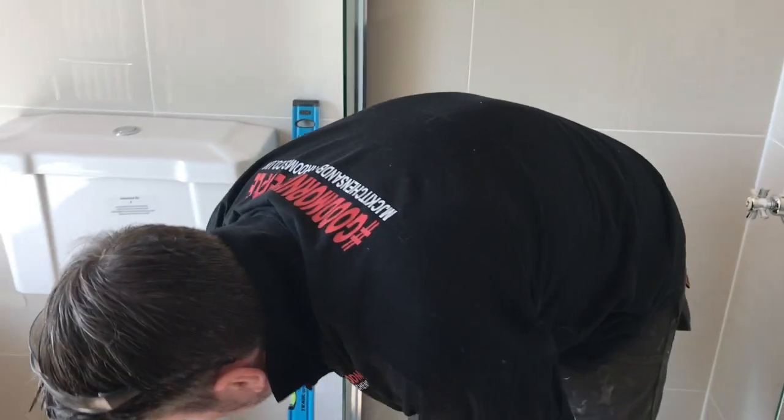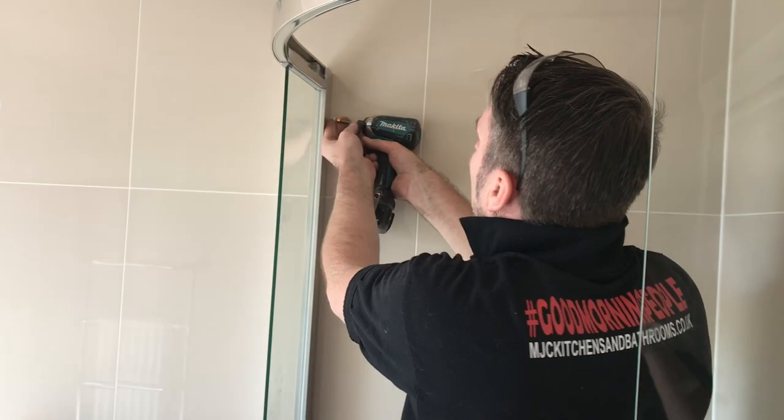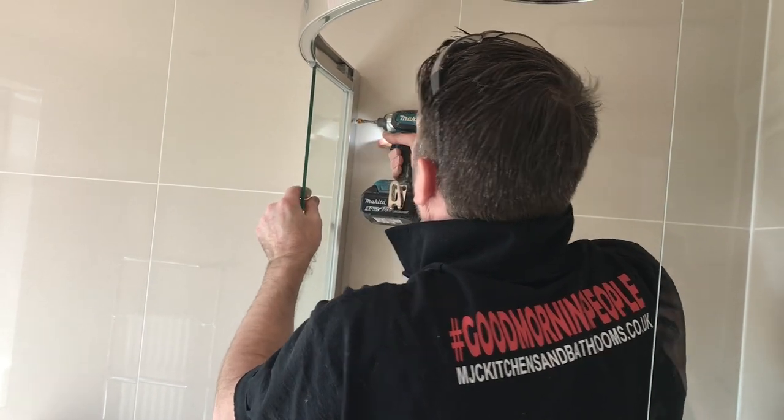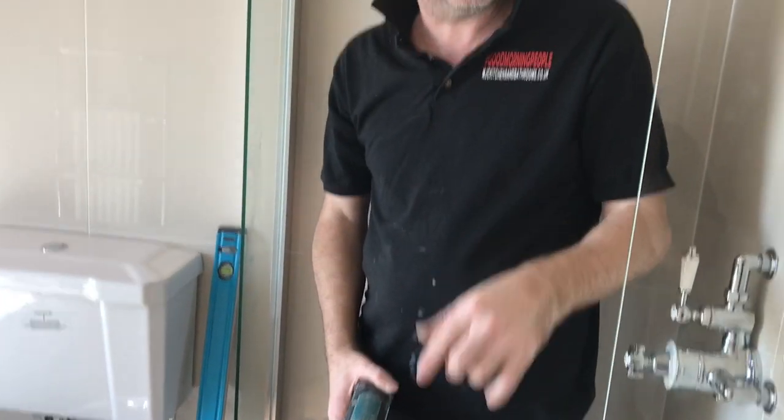You just get all the metal fibres all over. Get your screw in it. Use a posi if you're not used to running these. Don't screw it too tight, I've had you split it. Do that exactly the same all over. Stops all them metal fibres getting in your silicone.